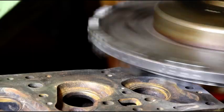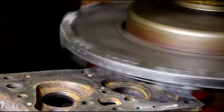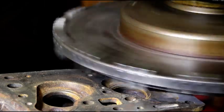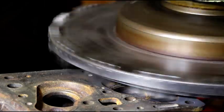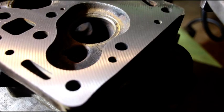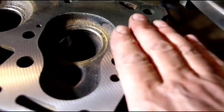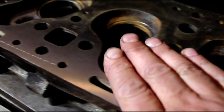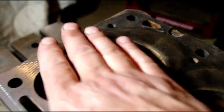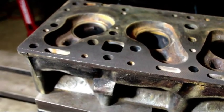I've got a slow feed going. I don't want to bore you watching the whole way through, but I think you get the process — we're just going to take a little bit off, see where we're at, and then go back and make a second and third cut if we have to. I've just taken about a thousandth off here. That was the first pass — you can see it cut from edge to edge at the beginning, and we started picking up the high section here, just tickling it through the middle. I think we're in good shape; we'll take another thousandth and see where we're at on the next cut.